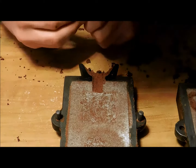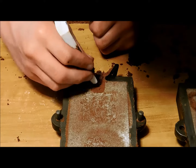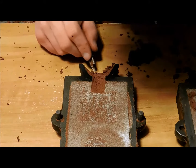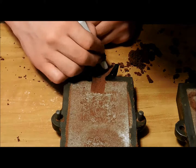Pretty much all liquid metals will have high surface tension, but with aluminum, that high viscosity and low density works against you as well. It's harder to get an even stream of aluminum when you're pouring, especially when you're pouring something like this that's relatively small.